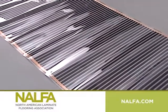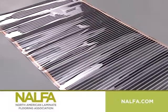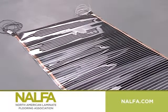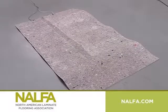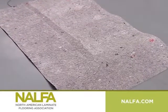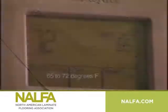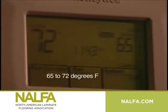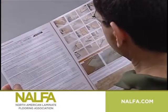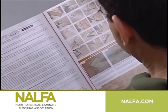Most laminate flooring can be used in combination with many types of in-floor heating. The heating system can be cast in a concrete floor, in a thin layer of filler on the surface of a concrete subfloor, installed under a wood subfloor, or installed on the surface of a subfloor as matting. The heating system must be in operation for at least two weeks prior to installation. It may be turned off or set to a suitable installation temperature of 65 to 72 degrees Fahrenheit. After installation, the temperature may be increased slowly at approximately 5 degrees per day and should not exceed 85 degrees Fahrenheit.